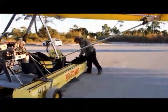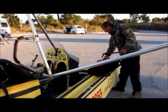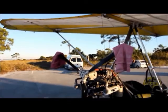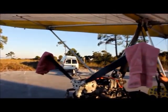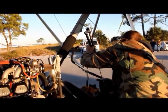Derigging the aircraft. He's just got the pod cover from the van and I put my wing protectors on - wish I had my good ones for the video. We still haven't been to the police to report the theft of his original prop covers by Michael Percy, the designer of the aircraft. We protect the propeller tips to prevent any wing damage if the sail touches the prop tips. Now he's putting the lift strut in.